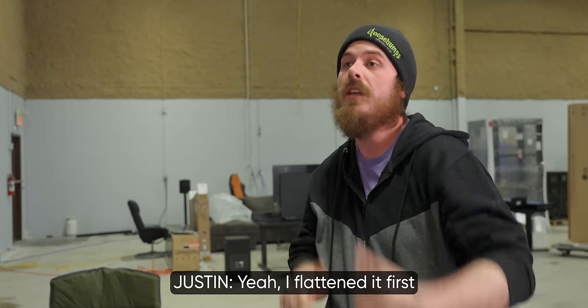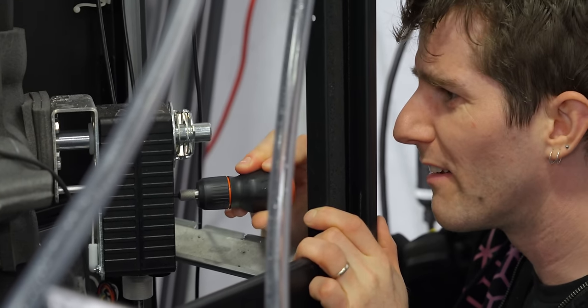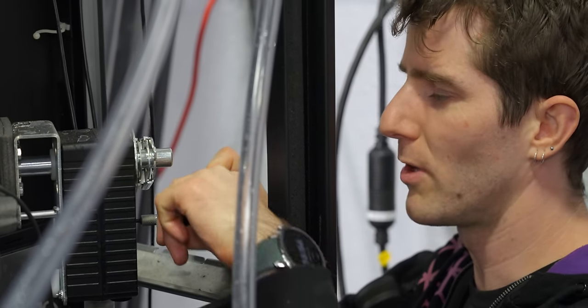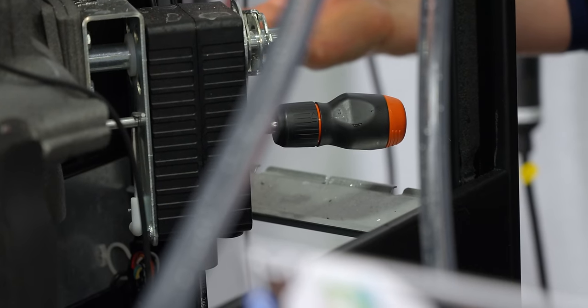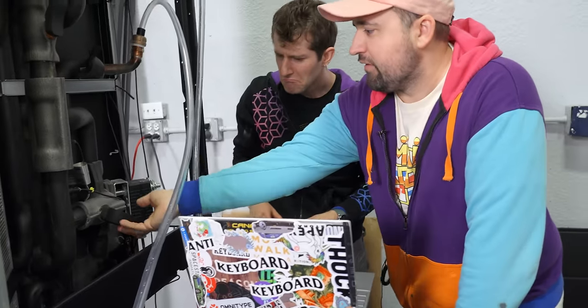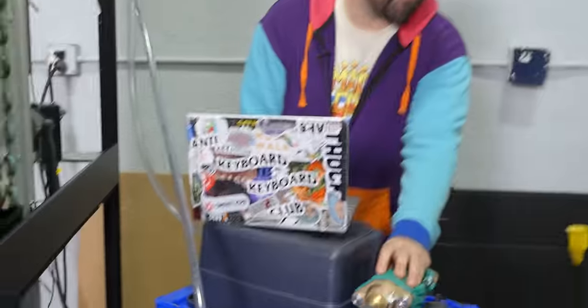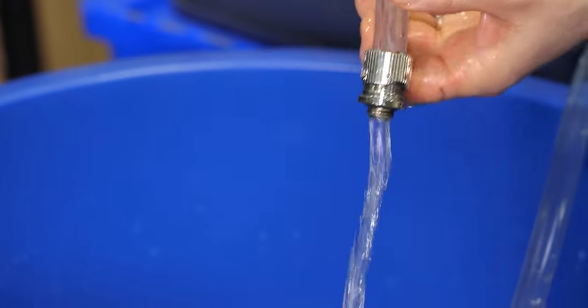Maybe for the start, we don't actually put it through the computer — we just circulate it and see what we get. Using a 2.5mm hex key, we turn the flow control actuator to the fully open position, and open the two-way supply valve and the two-way bypass shutoff valve. Let's turn our nicely primed pump on. That's pretty clean actually. They did service it. So we'll get the air bubbles out, let it go for a little while, and then hook it up to a computer.